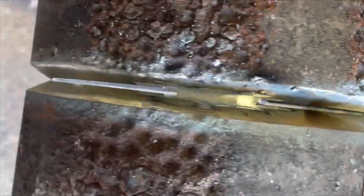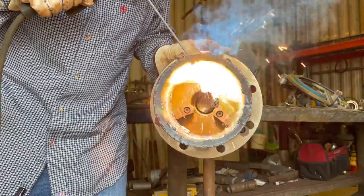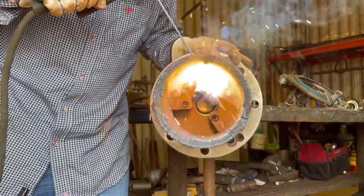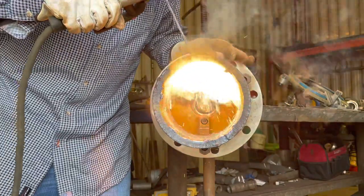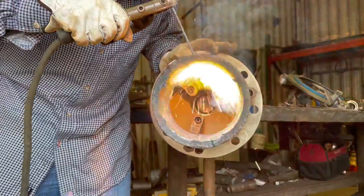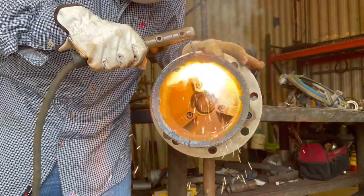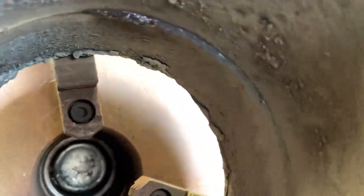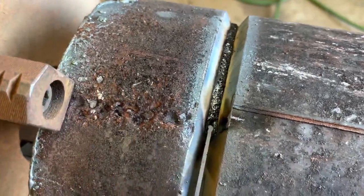This side is coming out — so far so good. It's a little cold but we're still fully fusing in there, as you guys can see. Our keyhole is still not out of hand. With this keyhole, I don't grind it — I just kind of flick it with my rod and go over it. Getting ready to tie into this here, so we're pretty much good.